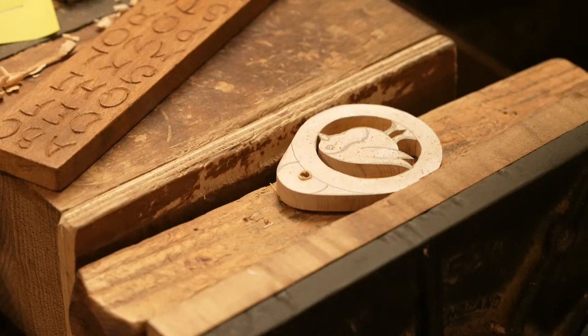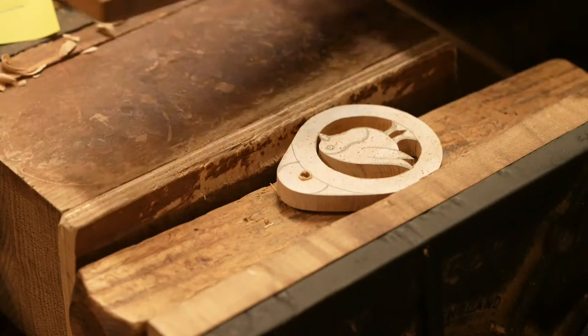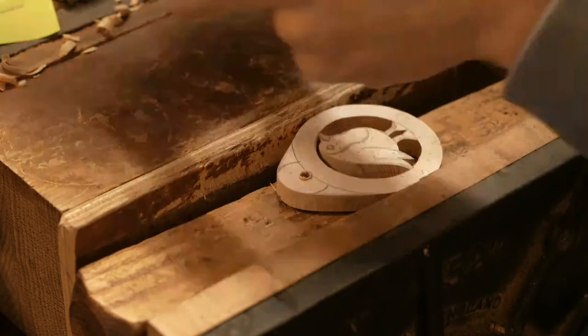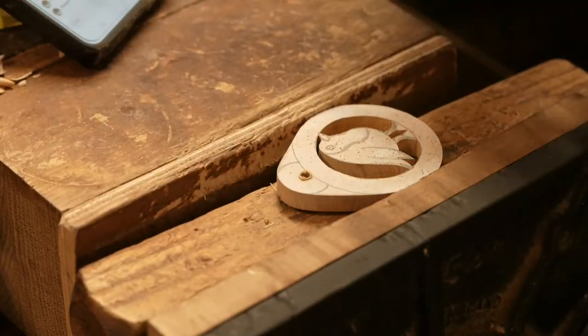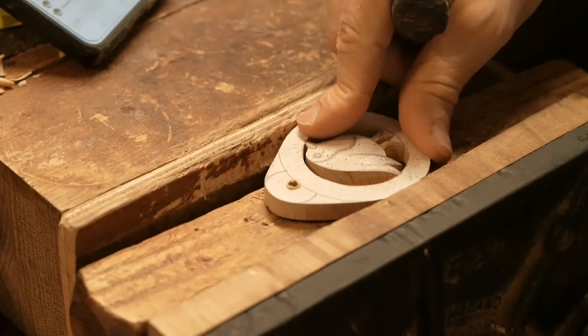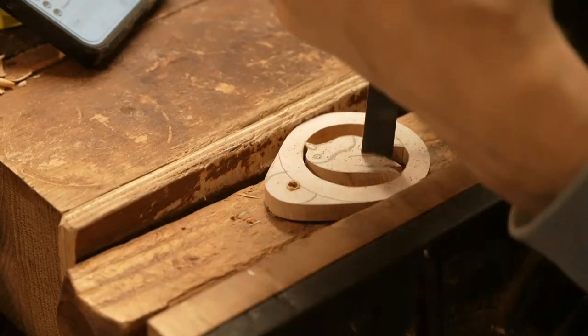Let's have a little look. Now I understand that lame numero tres. That's similar to Spanish, that one. That's the blade number that you're working in. So we're using probably, because of the thickness of wood, because we do the stack cutting, a much thicker blade than a number three. We're generally working at a number nine.